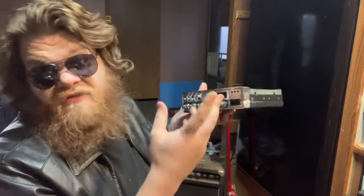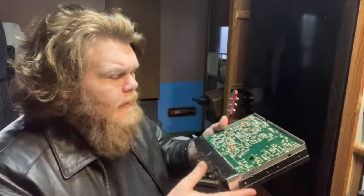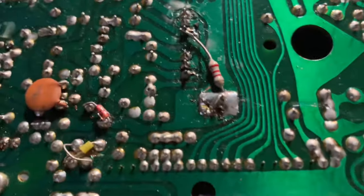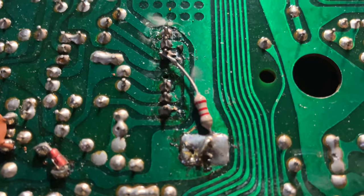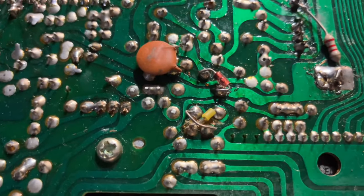You may remember in the last video I was checking out this Royce 613 and it didn't turn on, so I had to take the case off — which I had to drill the screws out of, because for some reason they were spot welded to the case. I ended up scratching up the chassis. During that process that little sticker on the face plate just fell off, so this once beautiful radio is looking rough. Unfortunately it wasn't just a protection diode that blew — some asshole has soldered a bunch of extra components on here. We have a resistor that's sort of soldered in, and a diode that looks like it might be factory.